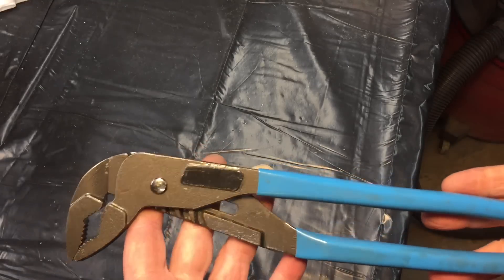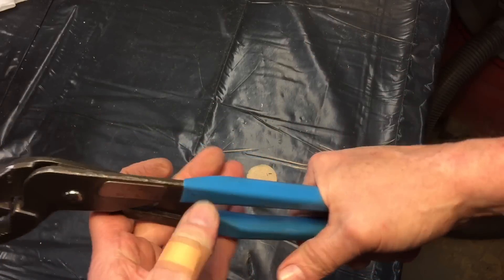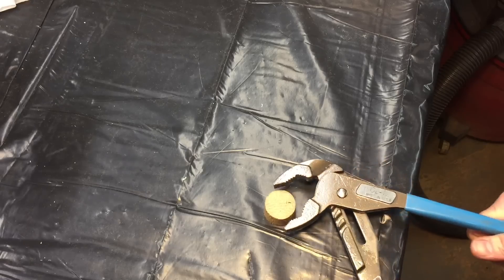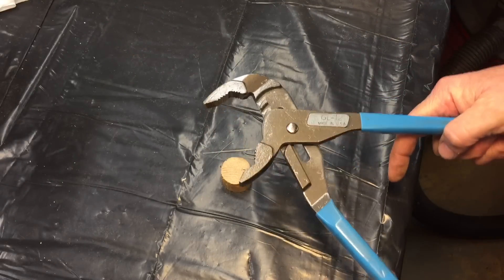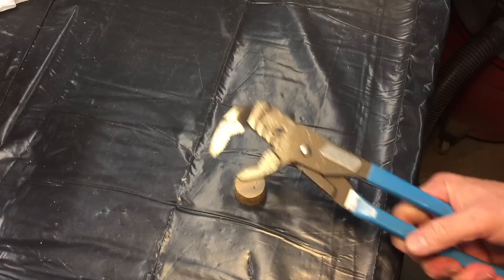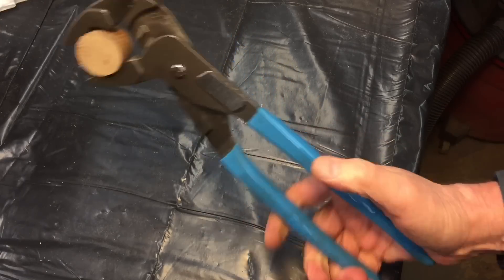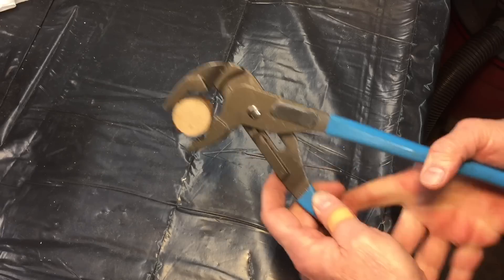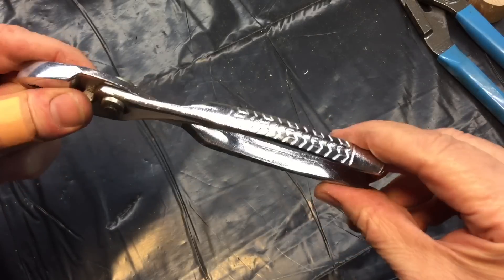Now this is a different pair — slip joint pliers, basically known as channel locks, with slip grooves here. When the handles are in this position, you have the optimum grip. But if we wanted to grab this round dowel here, look — I have absolutely no power here. So that's why this was developed, so you could slide this down and get it to the position where it'll grip the dowel. It would have to be one position above — you could grip the dowel and still have the handles fairly close. You have the options: go up one, but it's going to be very wide for some people — this is too wide for your hand.